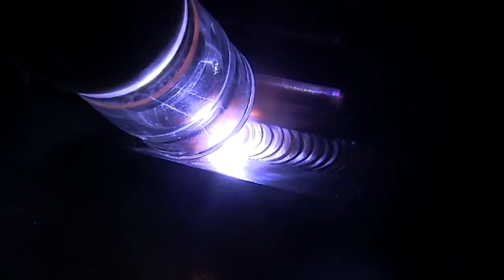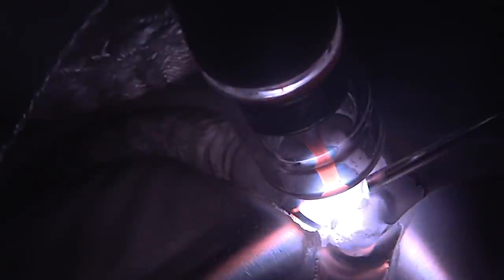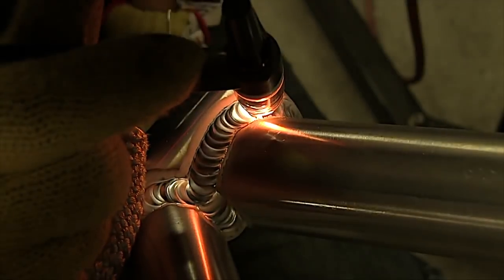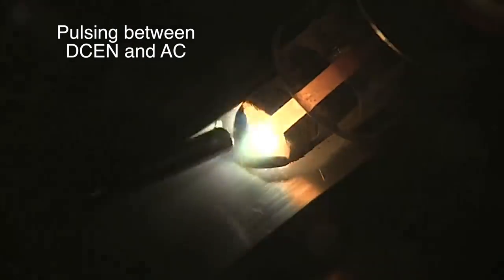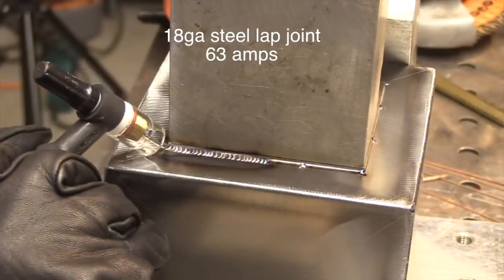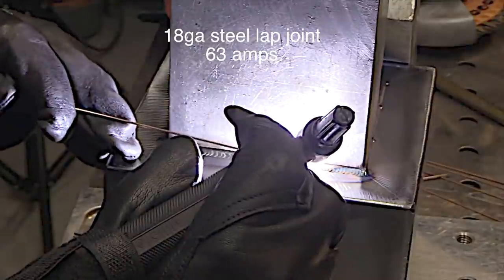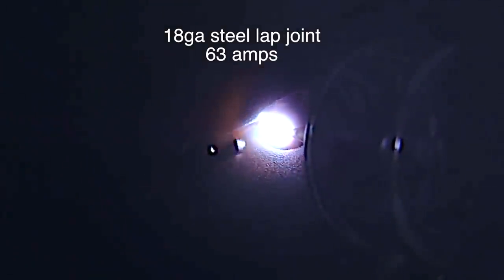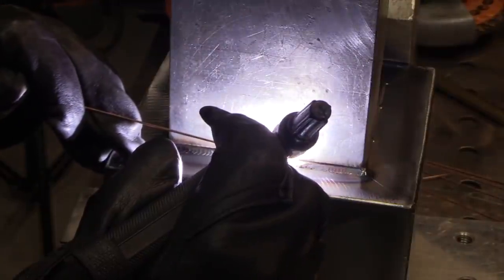Here's a shot from when I visited Mike Zancanato, a bike builder who was welding an aluminum frame - a really good example of being able to look through the cup. Here's an example of using something called advanced pulse, doing a quarter-inch lap joint where the machine pulses between AC and DC electrode negative for extra heat input and penetration. This is an 18 gauge lap joint, and sometimes on steel at fairly low amperage the arc doesn't give off all that much light - that's where a clear cup can really come in handy.